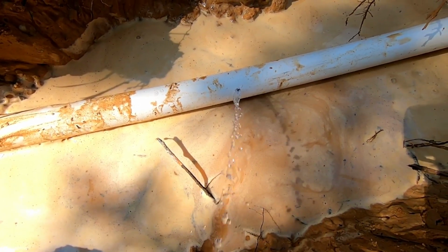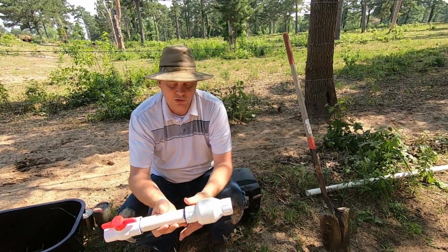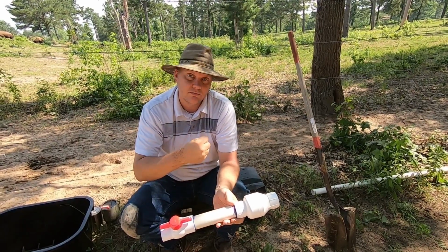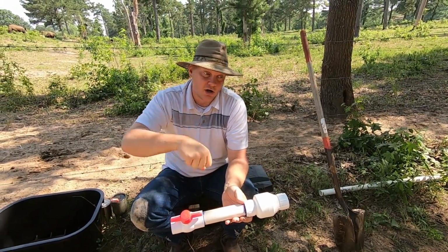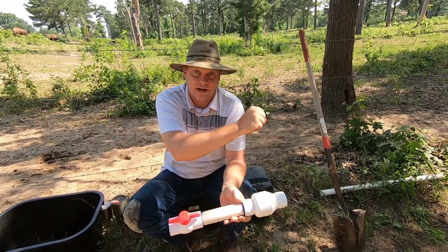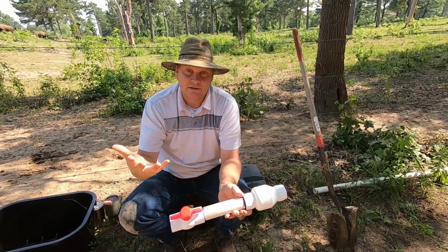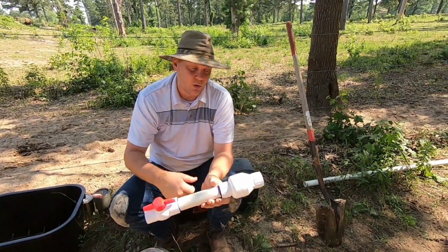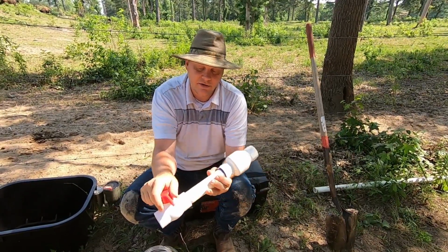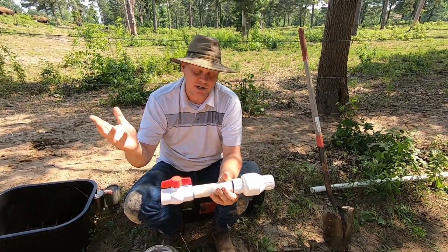So what we're going to do is put a one-way valve to stop the flow going backwards. This is really for when the pump turns on, or let me say this, when there's a draw of water, they don't want it drawing from all the other lines and out of other places, because then water won't turn on as fast at those spots, right? They're just trying to keep whatever's in each line in it. So they said, you know, put a one-way valve on it. So we're going to put a one-way valve on it down here. We're also going to put an on-off valve to be able to shut it off so we can do temporary repairs. We're going to have to add those down in other places.